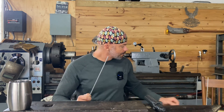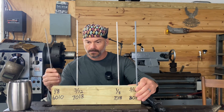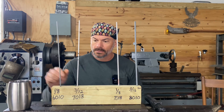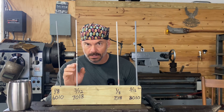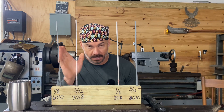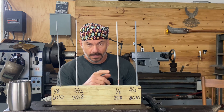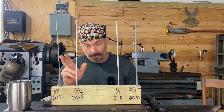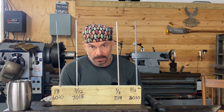Being in the middle works for all machines. Now when you get it running pretty good and feel like you've got the heat pretty much mastered, you can take your 3/32, which is one size down. This is a tip I learned through the years: the 3/32 7018 is going to run just a little too hot usually - the heat that runs that rod burns this one right a little too hot. Also, the heat on the 6010 to run just about right will run the 7018 pretty good too.